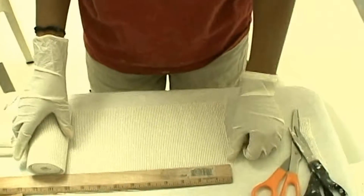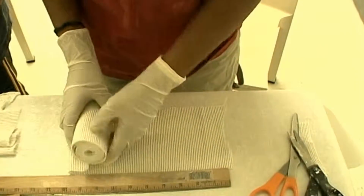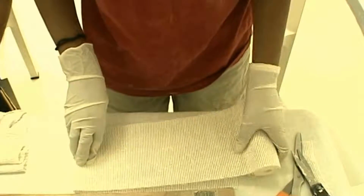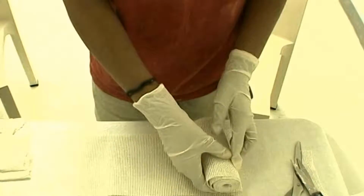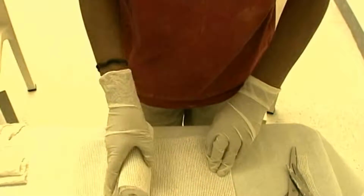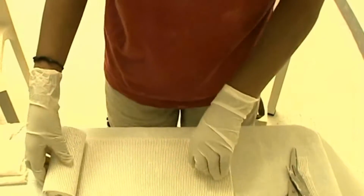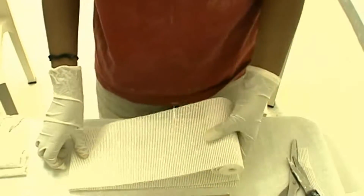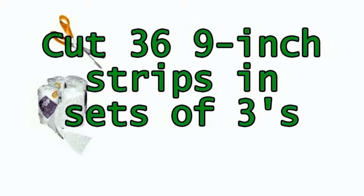The mother mold, or rigid shell mold, is made up of a number of plaster gauze bandages cut to specific sizes for ease of application. Each face casting requires 3 rolls of bandages. Each roll is 5 inches wide by 3 yards long. Here we're using Pop Art as they are lower in cost and higher in quality than any other bandage of the same type.